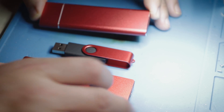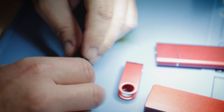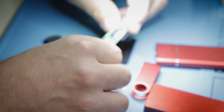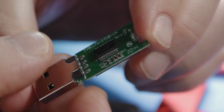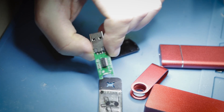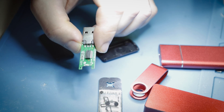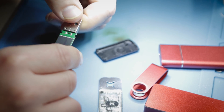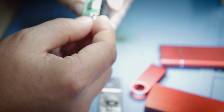Opening the USB flash drive first since it's the easiest. As expected, the FC117 controller is right here, and the flash chip is visible — they're really not hiding it. The reason they're using the FC117 controller is probably because it's the easiest one to modify firmware on. That's my guess anyway.